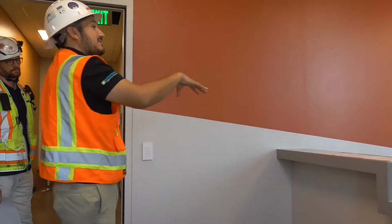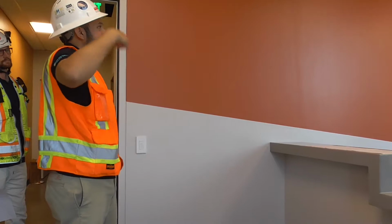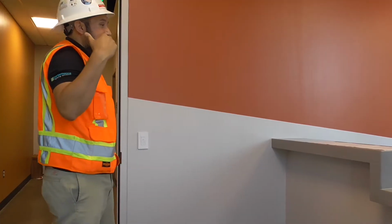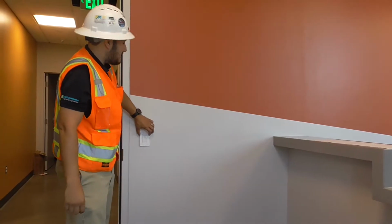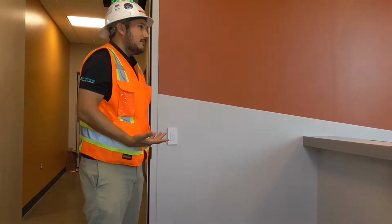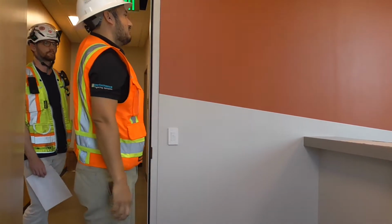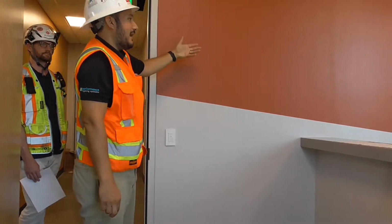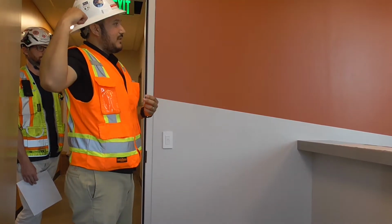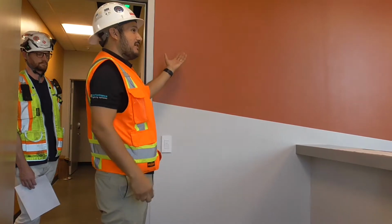All these rooms are going to have a similar setup. All these little offices go from their switch to their sensor. If there's a sensor in the smaller rooms, we have a switch that has a built-in sensor on it, because it's so small you don't need a ceiling mounted one. So it might just go from switch to the power pack out to a bridge that goes all the way back.